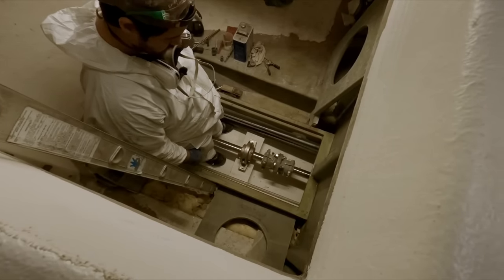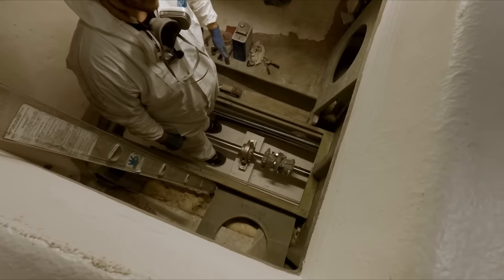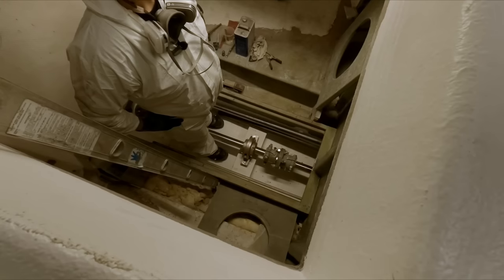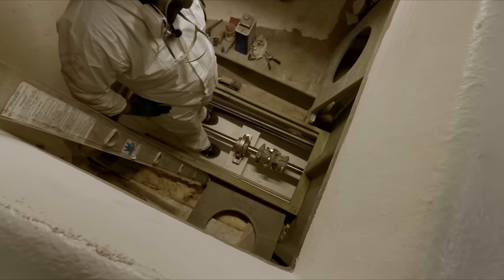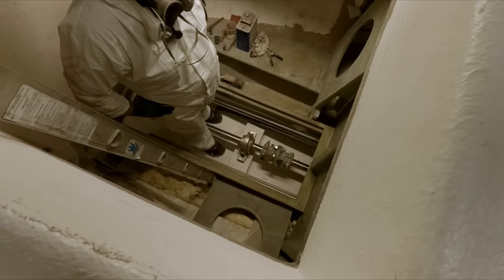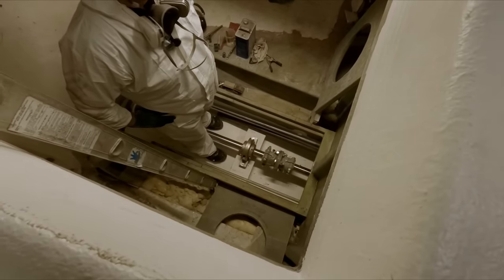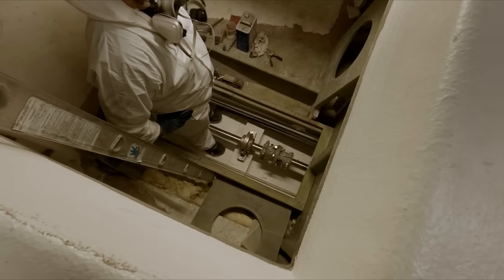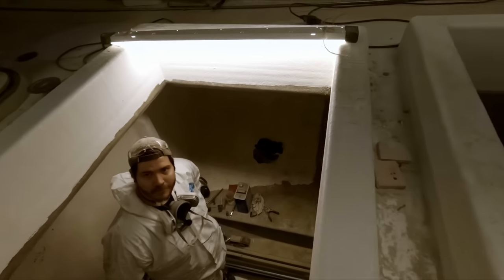I know it sounds a lot like overkill, but part of it's to help insulate the shaft alley. If we ever want to freeze on board, that's gonna be helpful to have that additional thickness. That'll give us about an R15 roughly, give or take a little bit less because of the hatches. The inspection hatches won't be quite as thick, but that'll help. Boy, it just got windy out. Yeah, I hear that. So, I'll pass you off to Matt here. You guys can check things out down there.